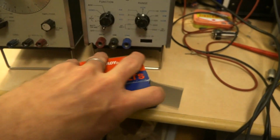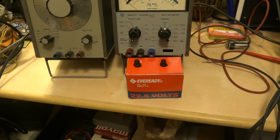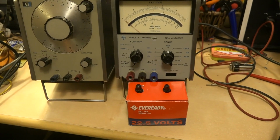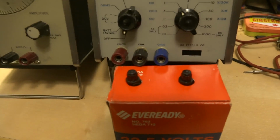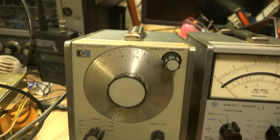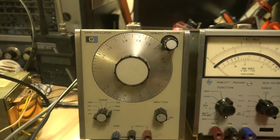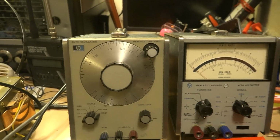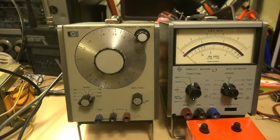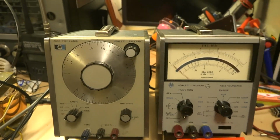So we'll go ahead and get this battery isolated from the regular trash and on a barge to someplace where it can be disposed of in an environmentally proper fashion. Yeah, right, huh? But anyway, that's going to be the future of this battery. And this is my 204C oscillator that works, and I've had it for probably 30 years. Sine wave oscillator, and it's built in the same form factor as the 427 meter. And so I'll be hanging on to that one. Might go in and clean the amplitude level pot. It's a little bit scratchy. See if I can spray it.